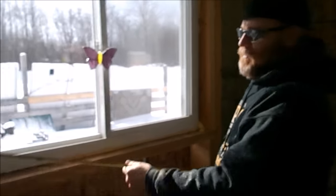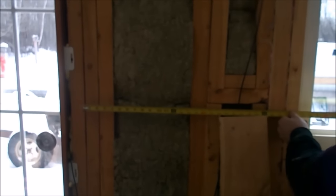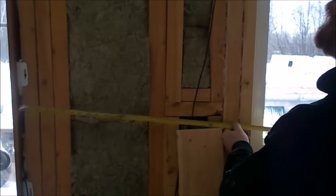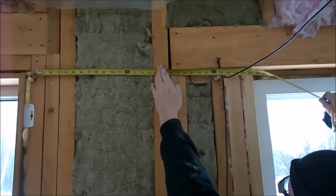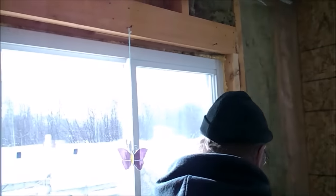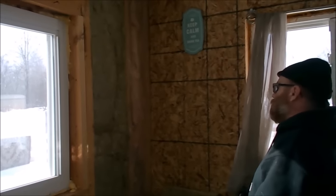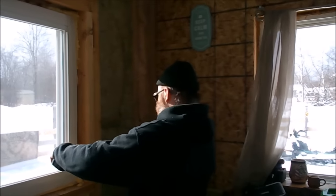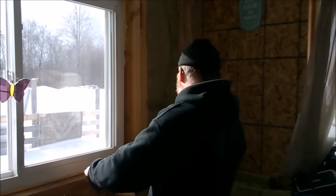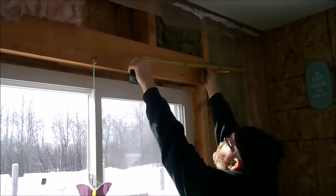So really if I went from somewhere here — where are the studs? 16 inches. Yeah, I see it's laid out. I started laying out everything from that side, but now I want to start from this corner. That's going to be a problem. So what can I do? Since I want to start my OSB here, I'll bring it over. So if I go from here, I can start from here. 16 inches, 32 inches. Yeah, so I'm going to start everything from here.